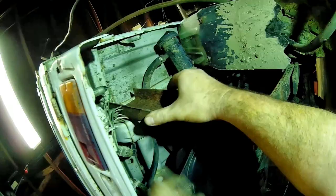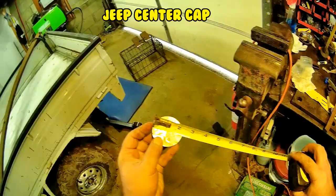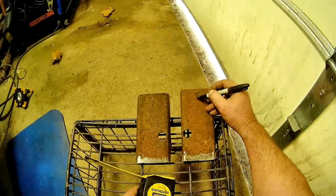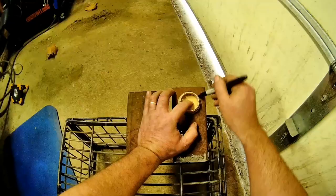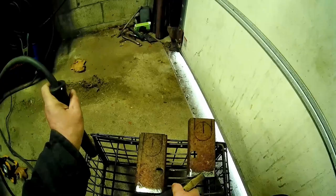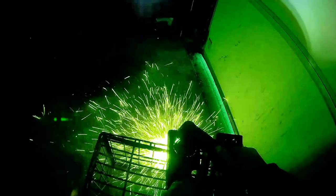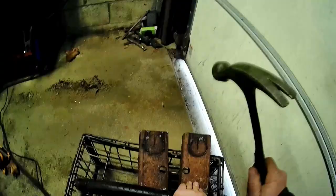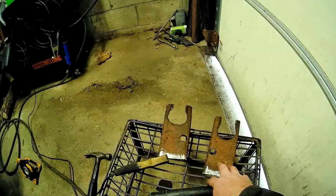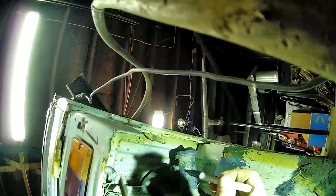So if I make that hole over like that, looks like I'm going to be welding that piece up to the front of this stuff. Look at that - that'll work. One and a half is three, a quarter, a little less than a quarter. This isn't exactly perfectly precise work anyway. I'm thinking once I weld this solid I'm not going to be able to spread that, so I'm going to have to run this hole up. I'm going to tap the hammer. I'm going to drill some holes, bolt it up in there, see where that bar is going to have to come across, and then weld that into this one.